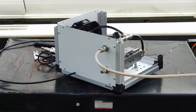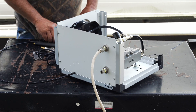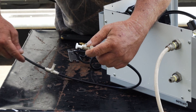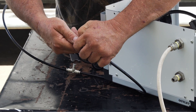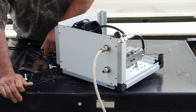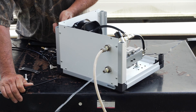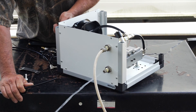Turn your water back on and plug your pump in to your receptacle. Go all the way to the end of your misting line — the nozzle farthest away from the pump. Remove the end plug. Before you plug in your misting line to the outlet, turn your pump on. Once you have solid water and no more air coming out, turn your pump off.